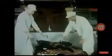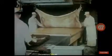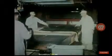At the fleshing machine, all residue of fat and impurities are removed. Next, the hides are stretched out on a table for final trimming. Salt, a valued preservative, is then added to make certain that the hides can be shipped to distant tanneries without spoilage. The hides are folded, tied, and are now ready for shipment.